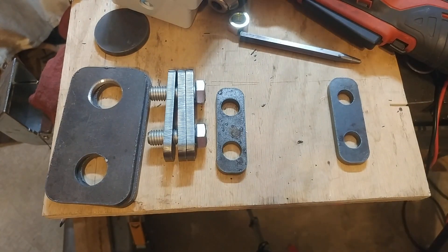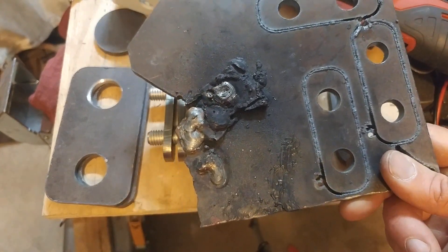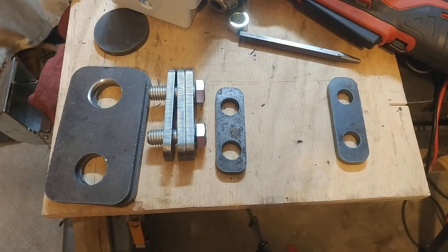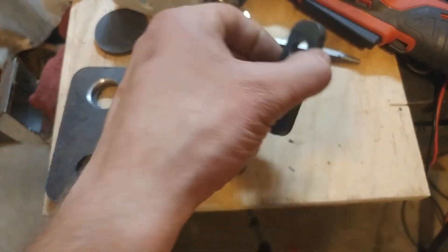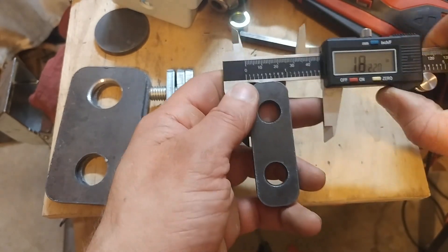So I went back and figured out how to accommodate for the kerf. That gave me all these guys, which as you can see didn't cut all the way. What was the problem? I messed up something else and put the feed speed way too high. Sure enough, going back and checking the G-code, there was a G1 F100 that didn't belong there — I was cutting twice as fast as it should have been.